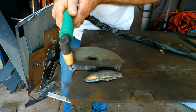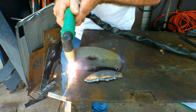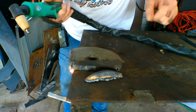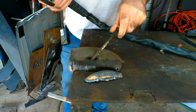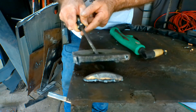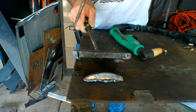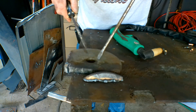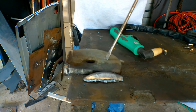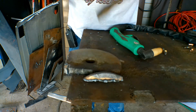That's what I'm saying — when you start cutting, cut from the edge. You always cut from the edge. See that guys, the sparks going down all the time, and as you can see it didn't blow out the tip — it just welded itself to the table! It actually severs it, it cuts through it when you cut from the edge. If you try and blow a hole through it first, you'll bugger your tip first. But then you're saying, Pete, what if I can't cut from the edge? What if I want to cut a hole in the middle? They suggest — and if you actually look in your owner's manual, not that anyone reads their bloody owner's manual anyway — they suggest that you drill a hole to start off with. Once you drill a hole in about the centre of your cut, put your torch through the hole and then start cutting. That way you don't blow all the crap back into your torch head.